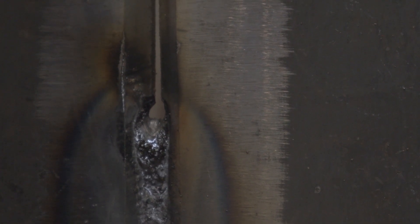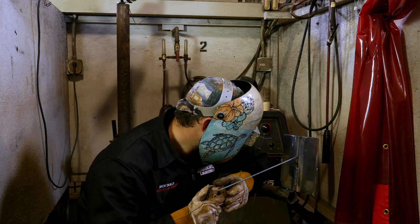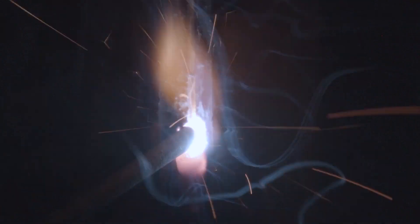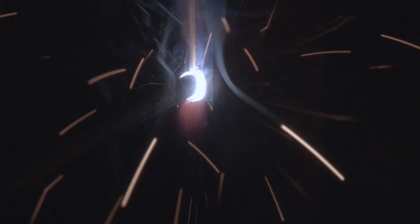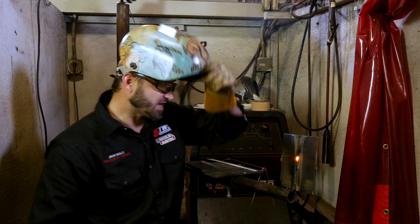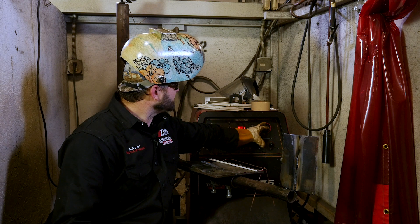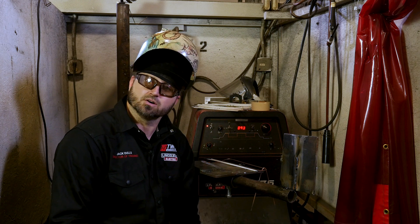It's getting a little tight on us here, as you can tell, so let's go ahead and turn it up. If it's getting so tight and you've got it buried up in there and it's not wanting to penetrate through, just stop. Turn the amperage up — it will make a hole, I promise you.